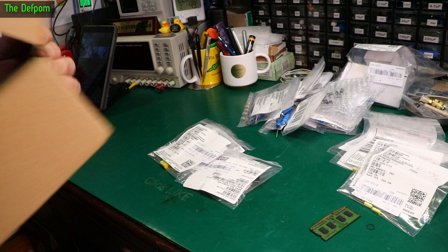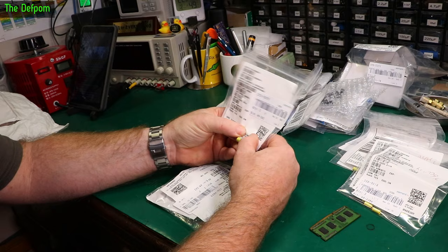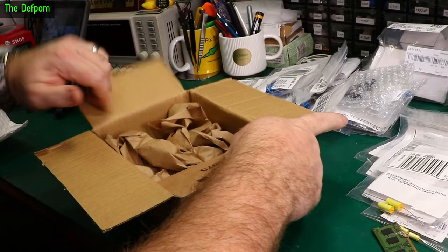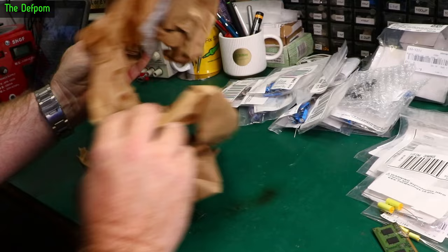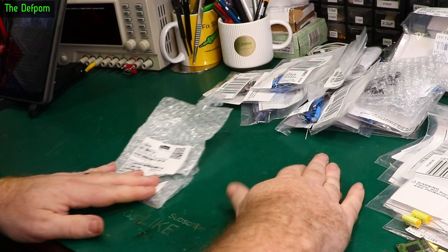Massive box. I'm having trouble getting out of this room because the pile of packaging behind me is quite high now. Electrical caps — what are these? 100 microfarad, 25 volt. Film caps: 470 nanofarad at 250 volt. Electrolytic: 160 volt, 100 microfarad. Big box. 22 nanofarad — is this X-class? I'm trying to find out if it's X-class or not. 20 microfarad, 305 volt — not X-class caps. We have 4 of them. That was worth all the packaging.